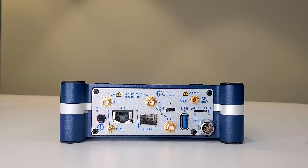On the upper left and center are the RF1 and RF2 ports that support sub 8 GHz FR1 bands. G-Flex has two FR1 ports which are required for LTE MIMO, 5G NR dual polarization testing, or for testing wideband frequency ranges requiring two antennas to cover the full range.